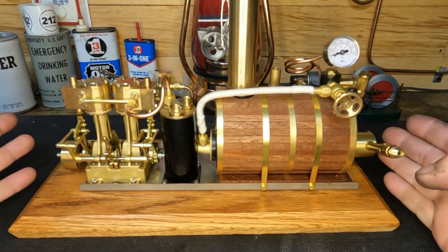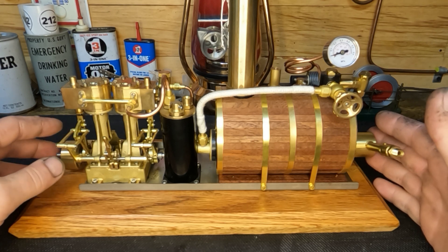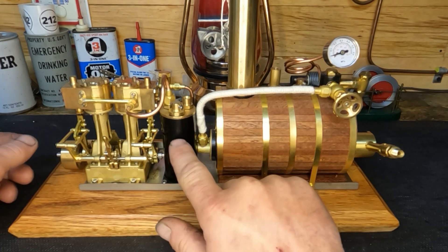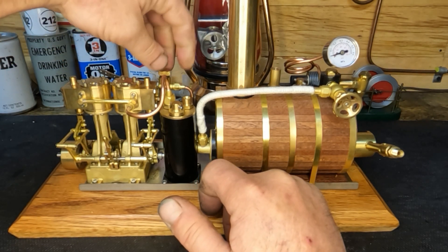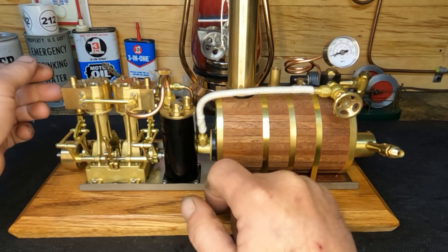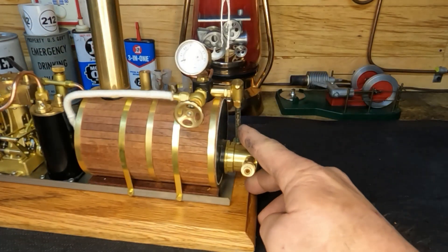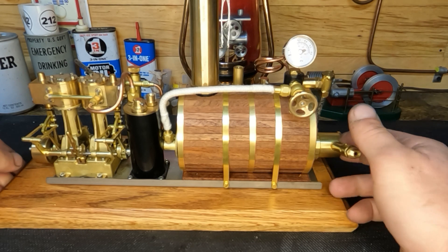This is a really, really nice assembly — this one came from Sterling Kit. It's an amazing little engine: twin cylinder, double acting, with a boiler and superheated steam. We have our condensing tank, and right in here we've got a displacement oiler. We've got our throttle here for RC use if one wanted to use it in a boat, and right here we have our steam control.